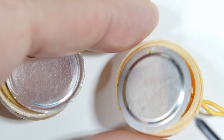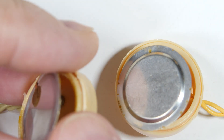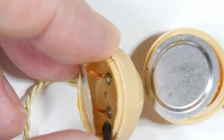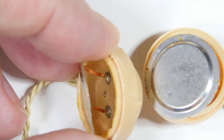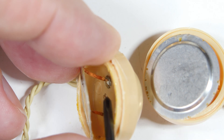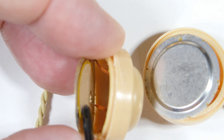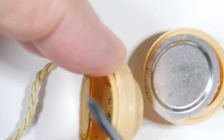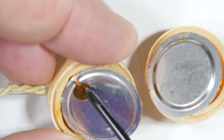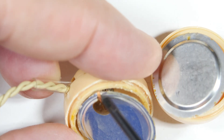I think the most telling thing is on the back side. Let me see if I can show you inside here — it's kind of tight. We have the two contacts from the plug, so there are some very tiny copper bands. One of them is soldered directly to the back of the piezo emitter right there, and the other one wraps around to the top. This just appears to be ordinary glue, and I guess the contact is coming from where it goes over the edge here.